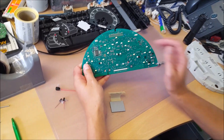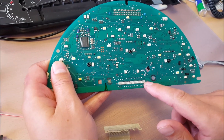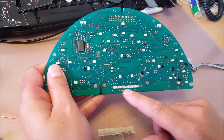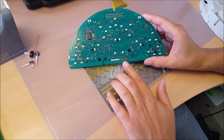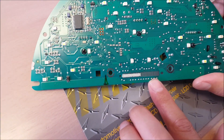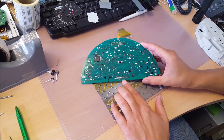Now the board has got carbon contact pads, so you have to be very, very careful cleaning this. You do not want to damage them at all. One half of the carbon pads cleaned — must be done very gently, very easily damaged.